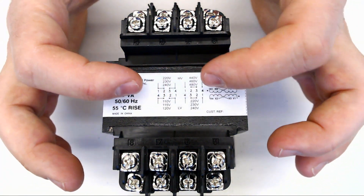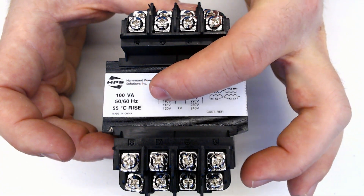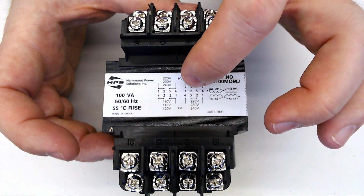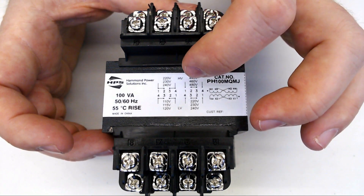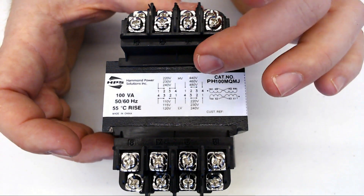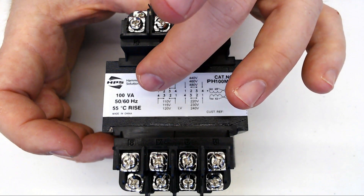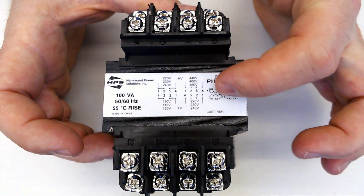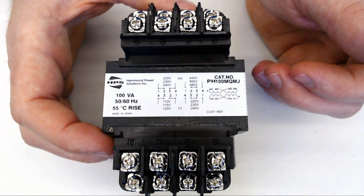Right below the diagram you'll see these little lines across it. On the 240 side it has two little lines jumping 1 to 2 and 3 to 4. Over here on the 480 side it just has a line going from 2 to 3, and then you have these long lines coming off — those long lines are your incoming power. So for 480 volt, you hook it to terminals 1 and 4, and put a jumper between 2 and 3. For 240, you put incoming power on 1 and 4 the same as 480, but you connect jumpers between 1 and 2, and then between 3 and 4. This basic line diagram is all you need to wire a transformer.